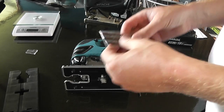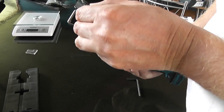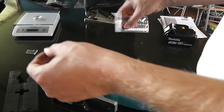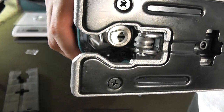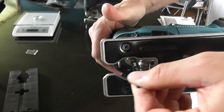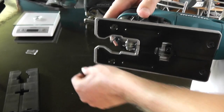Let's put a blade in. On the brushless you'll be able to just poke the blade straight in there, but you can't do it with this model — you need to flick that open. You can see it goes from a short slot to a wide slot; when it's on the wide slot, that's when you put your blade in. In like so — let go, and she's locked in. Pretty simple. Much better than the one on the Hitachi.